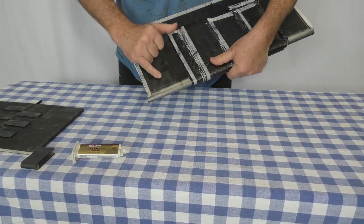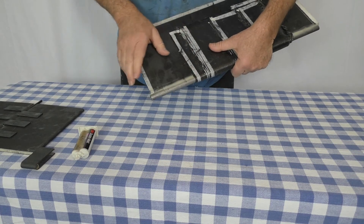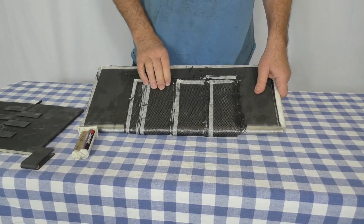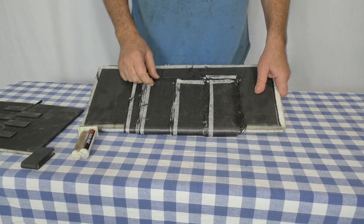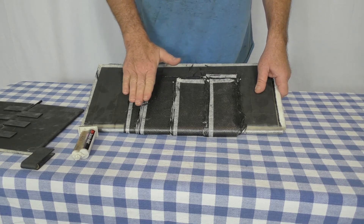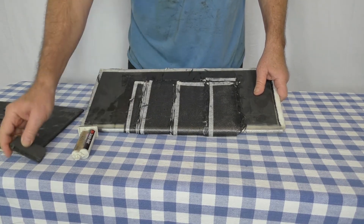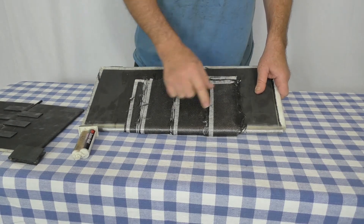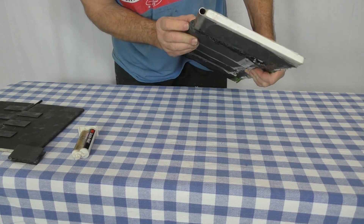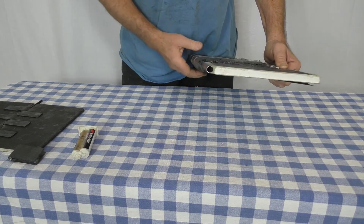Then there's some two-ounce carbon fiber cloth, and the bushing is bonded onto the front end of that. You can see the gap between the panel and the bushing is filled with structural adhesive, which provides a smooth, flat surface for doing the overwrap. Here I've laid up a bi-directional carbon fiber cloth — each layer is a standard 5.6-ounce fabric, plain weave. I've laid up enough layers so that I have essentially an eighth-inch thick panel, with 3/16ths and a full quarter-inch on both sides. It's actually a little over a quarter-inch. We'll measure these when done and go back and do more calculations to get an estimate of the strength.